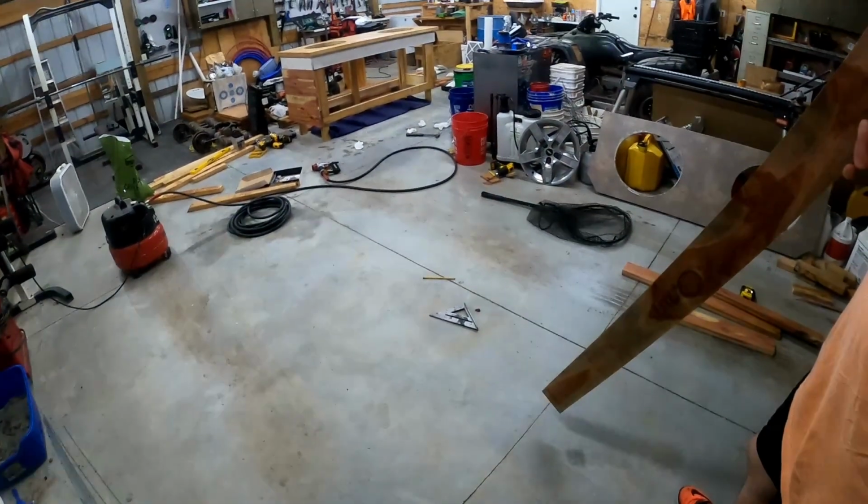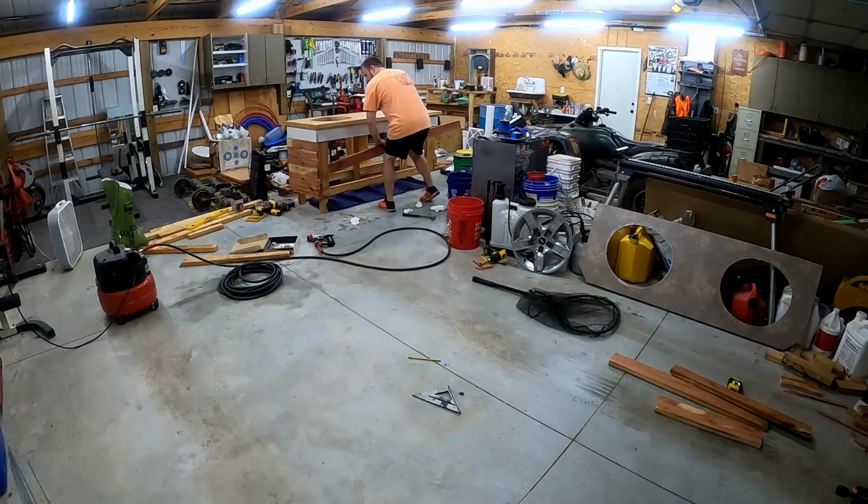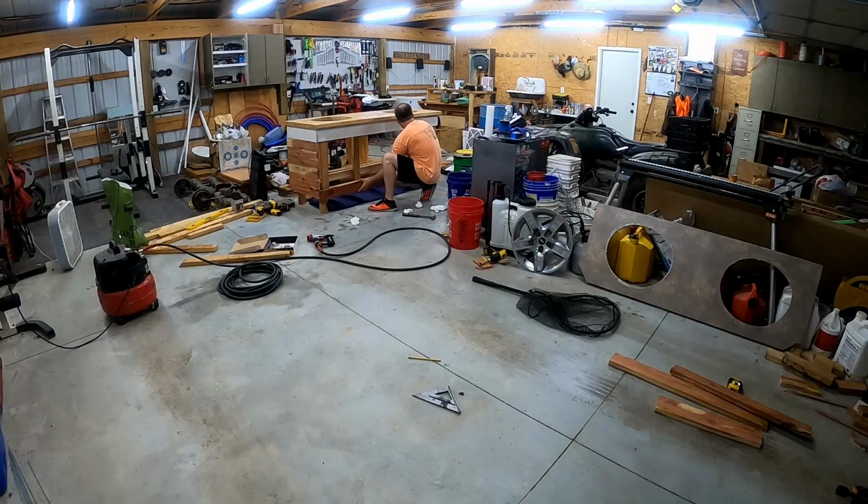We'll walk over here and you'll see where we're putting this one. This one is going to butt up right on the bottom there. We'll put it level with that 2x4, and basically it's just replacing that 2x4 for the facade. Select what side looks best with the top, because you'll have your board sitting on top of it. Also, with rough cut, you get some nice wobbly lines. I've got about a 16th of an inch high here, so you just have to adjust accordingly, and measure.